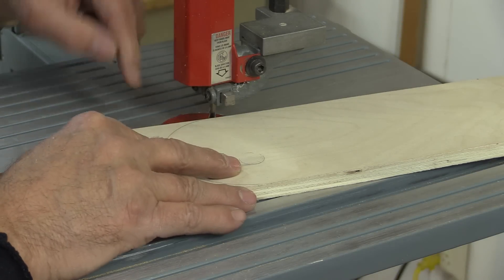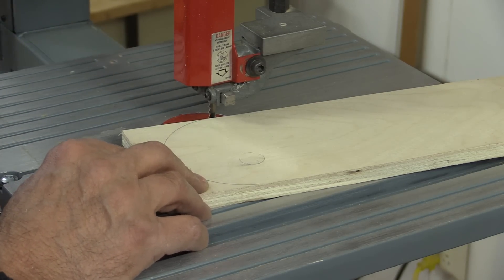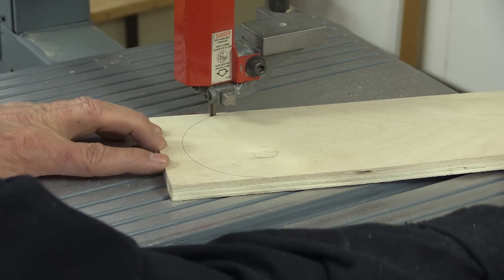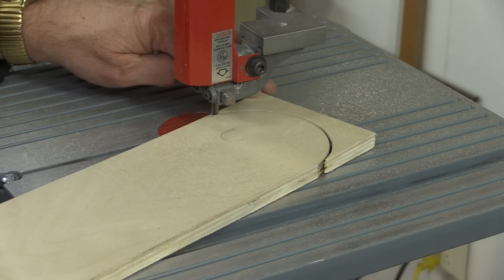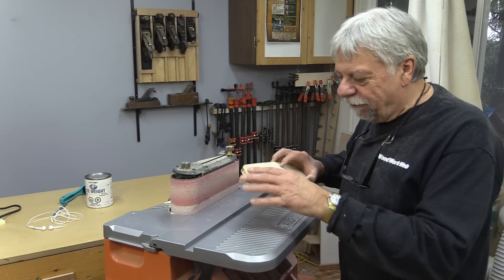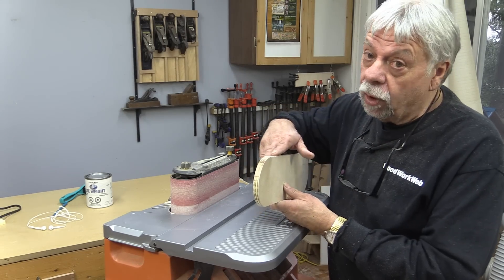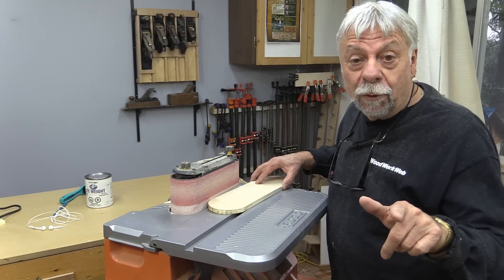What I've found is if I take my time and go as close to the line as I can, and then just do a tiny bit of sanding, these things usually fit the first time. I just checked the insert on my table and of course it doesn't quite fit — there's a little bit of a bump — so I'm lucky I have this horizontal belt sander. You could also clamp this in your vice and use a random orbital sander. There are lots of different ways you could do this. I'll quickly do it and make sure it fits, and then we'll be back over at the table saw.